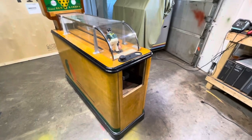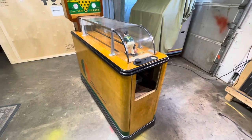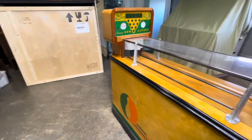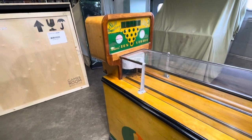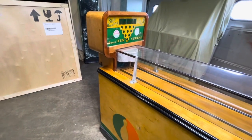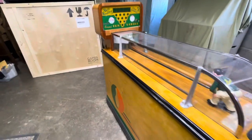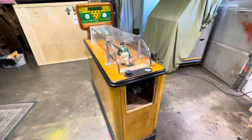So that's where you're at with that, and the only way to really figure it all out is start from scratch and trace and pull every one of those wires to make sure that the wire joints are good. Because there is a thing called the cold joint. I mean, you'll look at it and say it's good, but the only way to test that is to run the wire through a continuity tester to make sure that there's power going through that particular solder. So it happens.